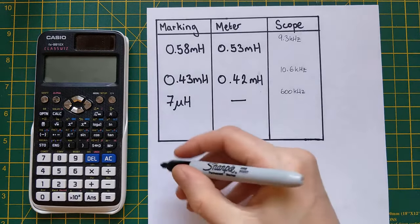The values are pretty close. This one was 0.5 mH, compared to the meter that said 0.53 and the marking that said 0.58. The 0.43 mH inductor was pretty close — the meter was 0.42 and the scope said 0.44. And then the 7 microhenry inductor: the scope recorded 7.7 microhenrys, but I couldn't detect that at all using my component tester, so this oscilloscope method is the only way I could do this. It doesn't normally have to be absolutely spot on, and I'm pretty happy with that. If you want to know the maths of where this comes from, I'll leave a link in the description. I hope you found that useful — thank you very much and see you next time.